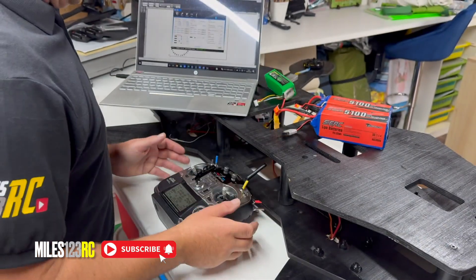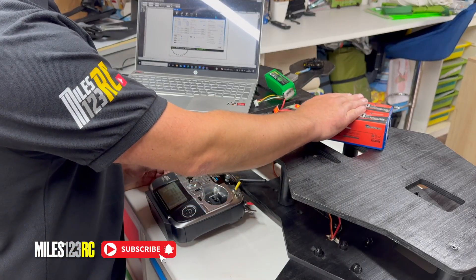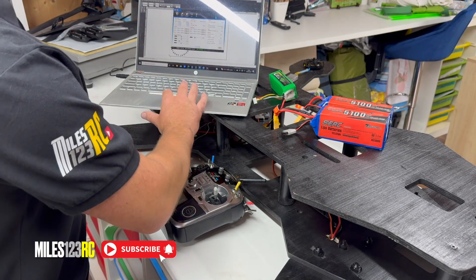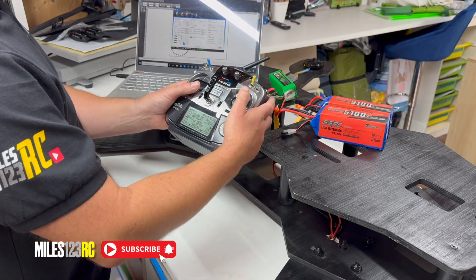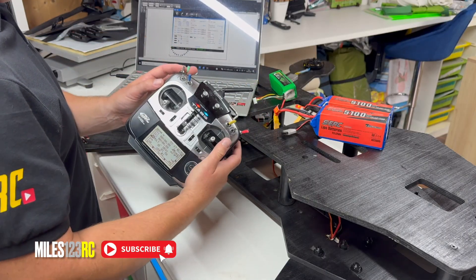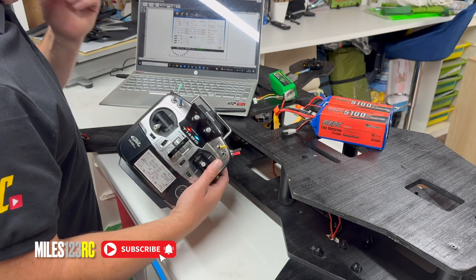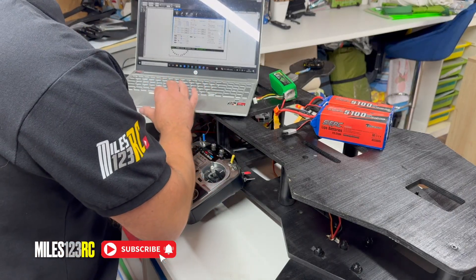We're all plugged in guys. We've got the camera up on the tripod. We've got the Futaba 14SG controller. We've got 12S powering the motors and 4S powering the flight controller system. The computer is plugged into the flight controller so we can just go ahead and make sure all our channels are mapped correctly — they're all sliding around on the bars on the screen correctly. I've got my flight mode switch for GPS, attitude mode, and return to home, which is also moving on the screen. The LED is changing colour on the back.